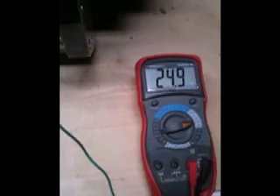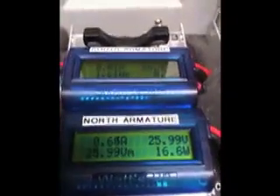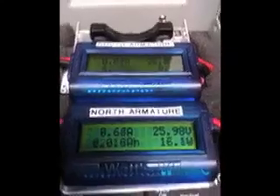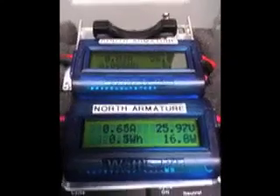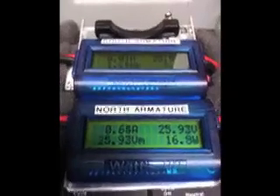Here's the maiden voyage of the thing. I'm only running one armature right now, and I have just 24 volts hooked up to it right now — it's just ticking along. At 25 volts DC output, I am consuming 0.65 amps. So it's interesting. I really think that there's going to be potential here. I believe for sure that it's going to be running a hell of a lot more efficiently than the small ones.